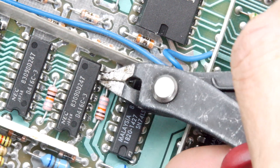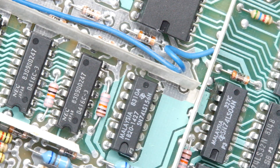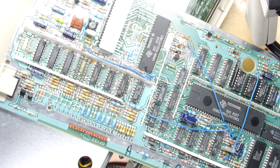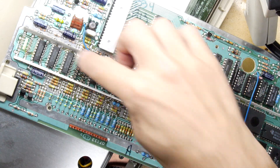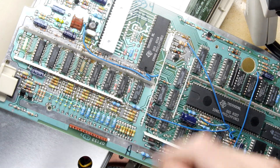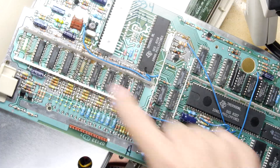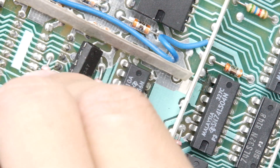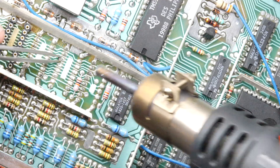Do that both sides, then remove the pins individually. I find that's just simple. I know it's a lot of pins, but the electric sucker is just a pain, especially on TIs, because they actually bend the pins off the ICs the other way when fitting them, so it makes them a nightmare. Better just to cut them, then take out all the little bits of pin with tweezers. When they're ready, a little wiggle might be all that's needed — they'll just pop off.